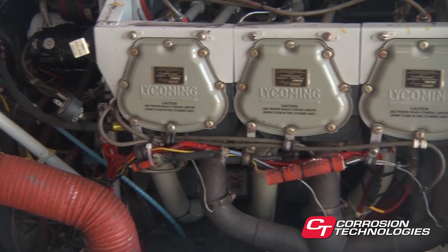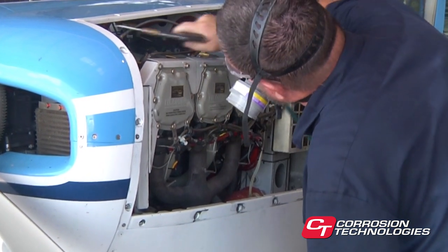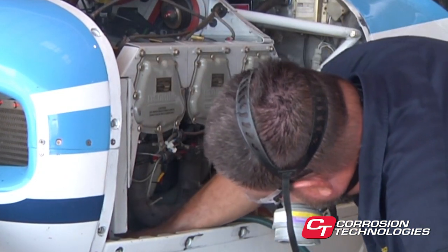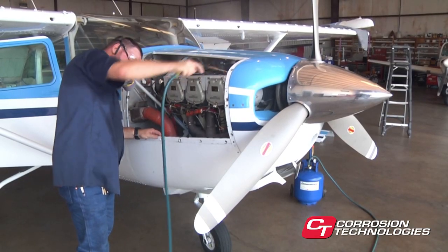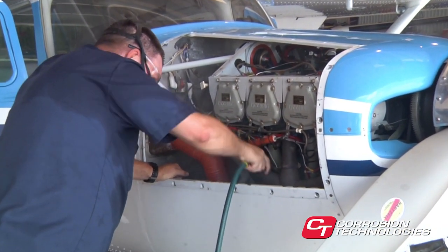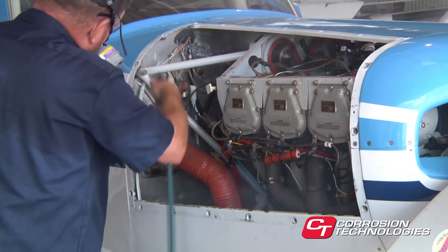Let's begin with the fuselage, and specifically the engine and engine compartment. Note that we've covered only the dry vacuum pump inlet with plastic wrap. It won't be necessary to cover engine components, but avoid spraying on any belts and filters. Keep in mind that CorrosionX is an extraordinary lubricant, which can render friction-dependent components inoperative until the CorrosionX is thoroughly removed or worn off. We begin treating the engine by making an attempt to reach all areas. Moving to the other side of the engine, we continue that process. You will probably want to use the Cricket or Superflex wand for the engine, whichever you prefer. Keep in mind that there will be some dripping of product, so it's a good idea to treat the lower sections first, as you will need to get under the aircraft eventually.